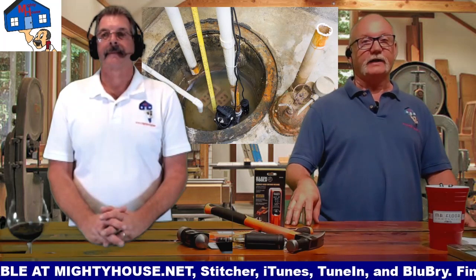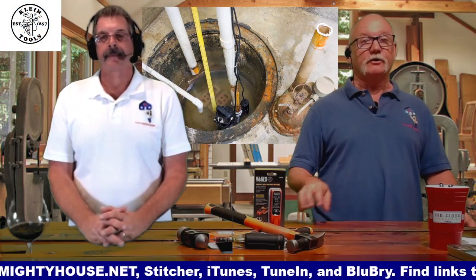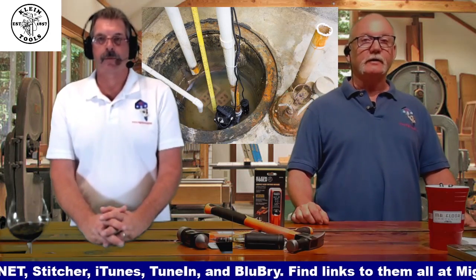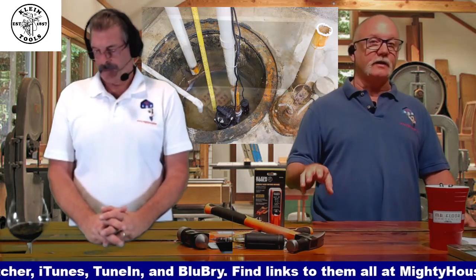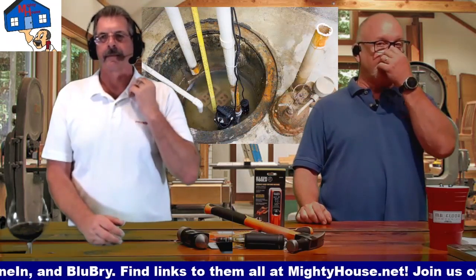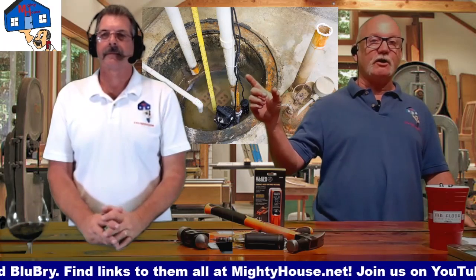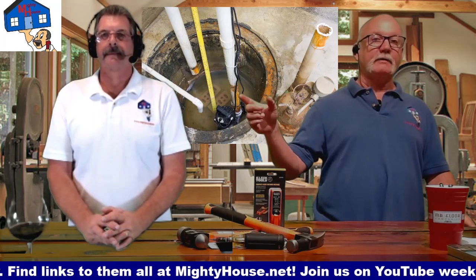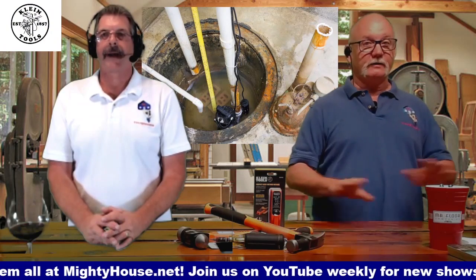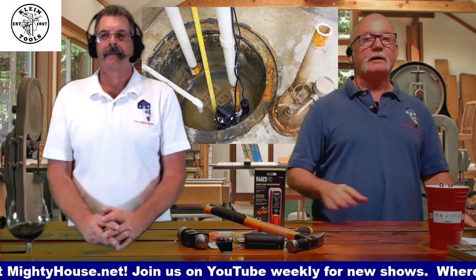Or if it's been activated, it will let you know. So that way you know your main pump's out and you need to replace that or repair it in some way. And then the last thing on the battery backup is to actually pipe that out separately. In case your main pipe gets clogged, your battery backup should be piped out separately, like this one is here. And then that way you're covered. You don't have to worry about a bad pipe or anything like that.